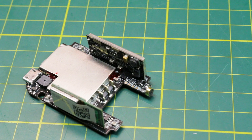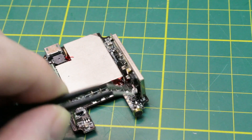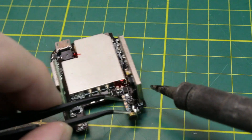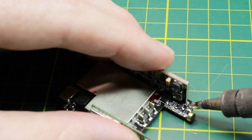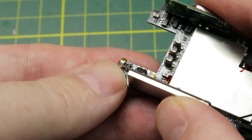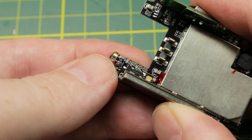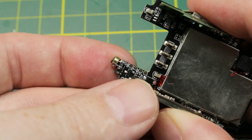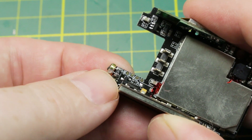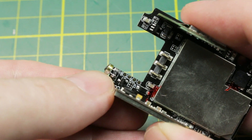We'll take our tiny resistor in a pair of tweezers and set it across the two terminals that we've tinned. When we get it across them, we're just going to touch one side. When you're done, if you held your tongue just right, you'll be left with something like this — you can see the tiny 330 ohm resistor across there. Make sure you didn't bridge ground or the case of the microphone. You can also use a through-hole resistor here, but the SMD ones, even though tiny and fiddly, do a much better job than trying to find room inside the case for a through-hole resistor.